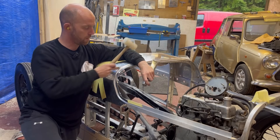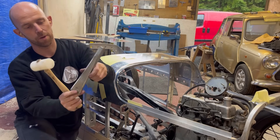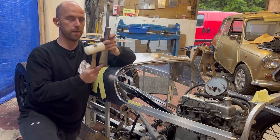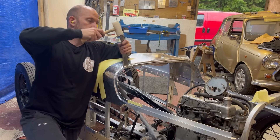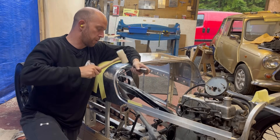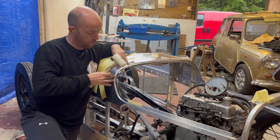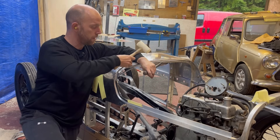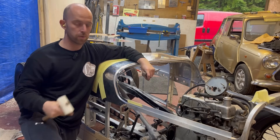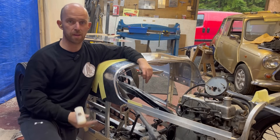What I'm going to do is just hammer this down back onto the frame. I'm going to use this — it's called a chaser. When I was 16, I made everyone in the workshop — the tin shop, we called it at Morgan, where I was an apprentice — one of them. It's basically for when you put that swage in on the scuttle: you're going to hammer it down towards the frame, and then this lip that's flicking up — you turn the chaser onto its side and you hammer that back in. You keep repeating the process until it takes the form of the frame underneath. Any excess I've got through there I'm going to use a shrinker just to tighten that up, and then any lows I've still got I lift back out and keep repeating that process until you're happy with the end result.